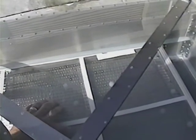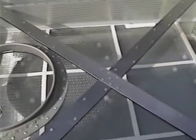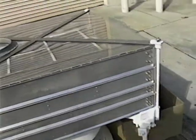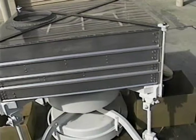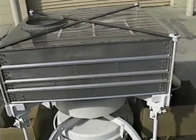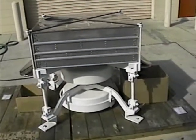The product goes through the screen and goes off to either side and drops directly down into the hopper where it then comes out. The overs will come across the second screen and drop out the opposite side of the sifter. This unit can have seven decks stacked on it for a total of 35 square feet of cloth. The more screen area or cloth area you have, the more capacity you can get through the sifter. This particular sifter will handle up to about 48,000 pounds.